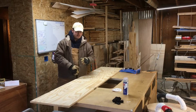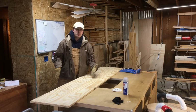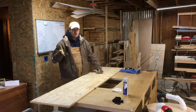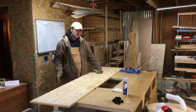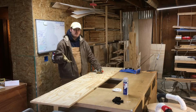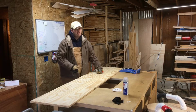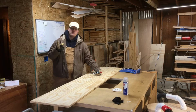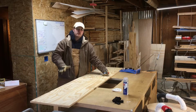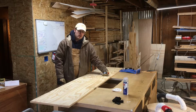So a problem I had, I don't really have any pictures of it, is I don't have a jointer, but I do a lot of glue ups of tabletops, so I have to get a straight edge. And the horror situation happened, the phone call you never want in your life happened of, hey, I got my project home and the tabletop split. Part of that was it was too cold when I glued it up. Part of it was I probably didn't use enough glue. Owning my failures, like own your failures, guys. Do everything you can to make it right.